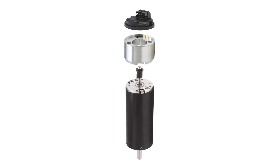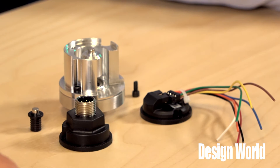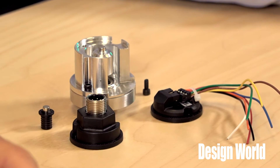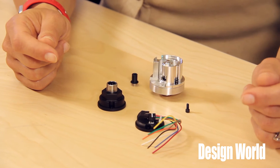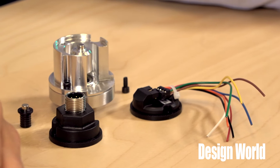This is a compact magnetic encoder with a large air gap and good tolerance for misalignment. It delivers up to 1,024 counts per revolution, or 4,096 pulses per revolution with quadrature counting, plus comes in versions with 2, 4, or 8-pole commutation. The encoder can also handle extreme industrial environments with sealing to IP69K and the ability to run in temperatures from negative 40 degrees to 120 degrees Celsius.